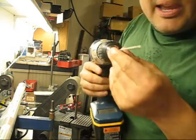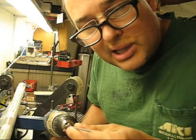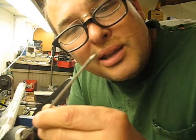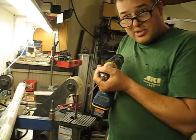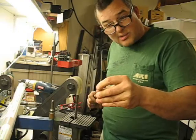And you can see my grinding lines go the right direction, and I come up with a pretty nice point on the tip. Pretty simple process — you just back off your tool and rewind it, and there you go: nice sharp tungsten.